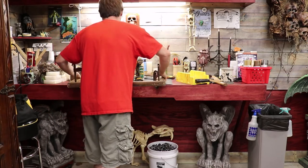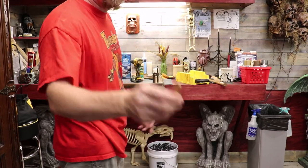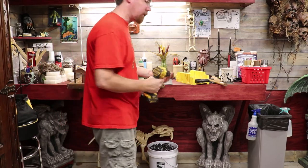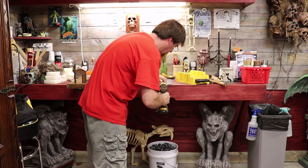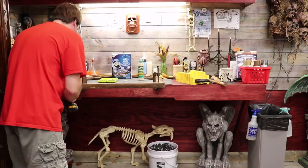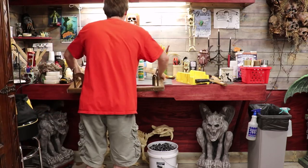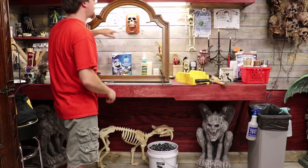I'm happy with that. I think we'll go ahead and put our screws in. I went ahead and pre-drilled a 1/8-inch hole all the way through, and then I countersinked a little bit so that our screw heads won't be seen from the underside. So even if I put this up high in the air, you won't see the screws on the underside. They're black anyway — these are just cheapo drywall screws I'm going to run in here. All right, we're done. Got our screws in there. That's going to hold us.